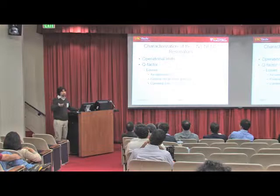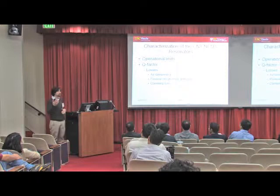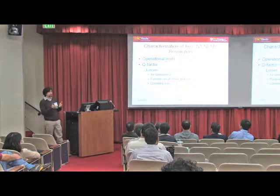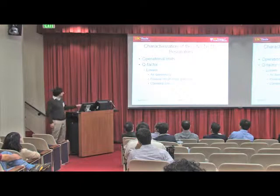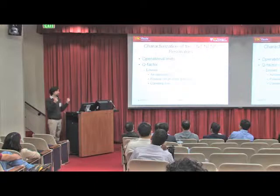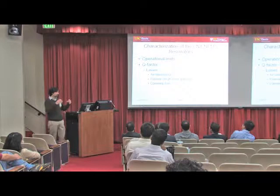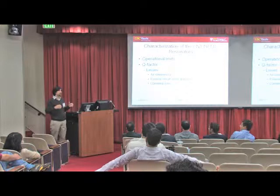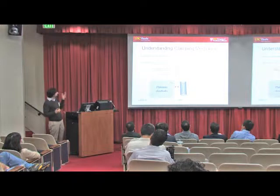These are all applications, but one has to understand the meta-system to actually make it work much better. One aspect is the operational limits: how cold or hot it can get, how high frequencies can I achieve. There is also the Q-factor — it's a resonator, and the Q-factor tells you how high a resolution you can get in terms of frequency shifts, like how small a mass or tension change you can detect. Losses are very important. This resonator works in vacuum, so air dampening is a crucial factor — if the pressure is too high, it doesn't resonate. Another issue is passive circuit impedance matching, because these materials, even though they are nano and great, don't work well with our 50-ohm standard — they're all hundreds of kilo-ohms. The other mechanical factor I study is clamping loss.